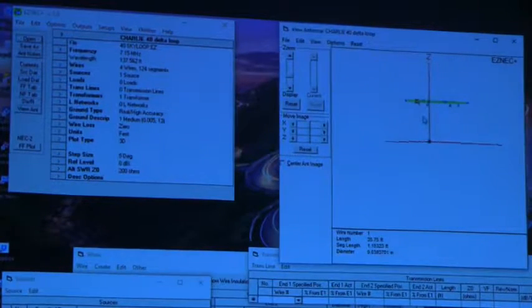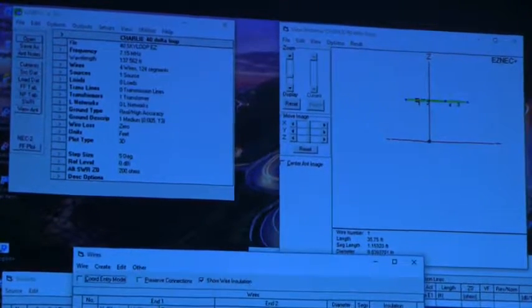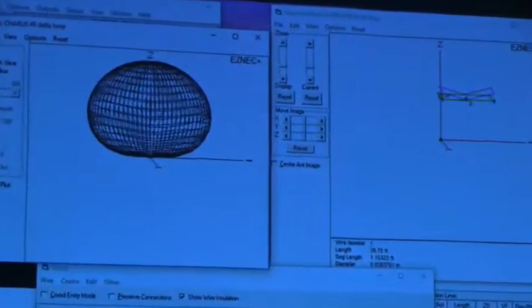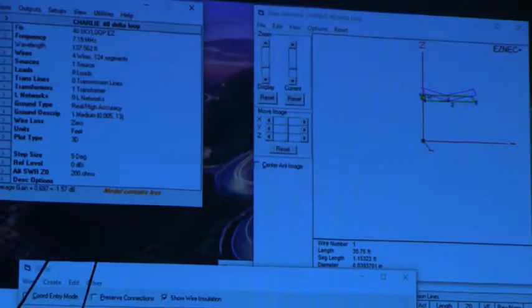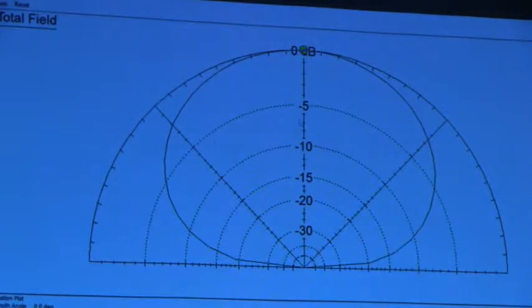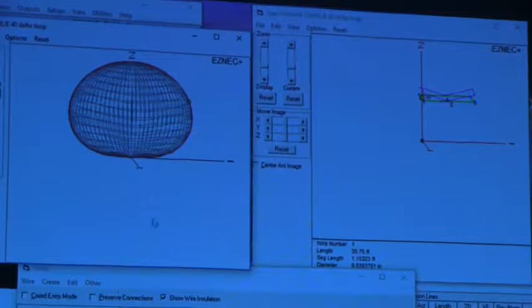Yeah, here's a 40-meter sky loop at 34 feet. Or 30 feet. All right, what you got? What's your pattern? It's straight up. All right, now look at the gain. 6 dB, straight up. At how many feet? 30 feet. So it gives you more gain than a dipole would at that height.